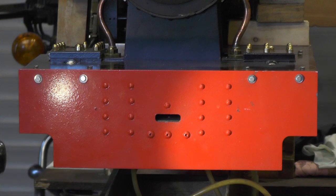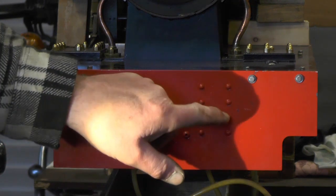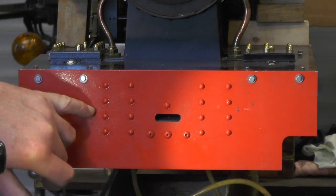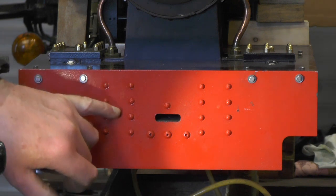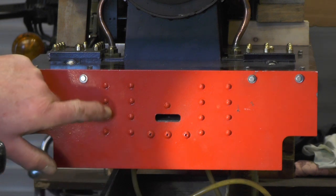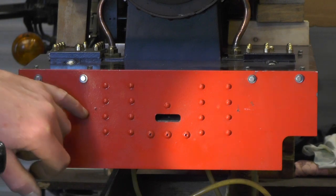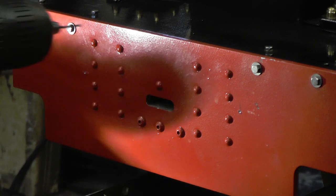There's just one thing I'm going to point out here — where the buffers are going to fit, two of my rivets are in the way. What I'm going to do — I know I've painted them now — but I've had a look and I can grip them with a centering on the bore, and I'm going to dish them out so that the rivets fall inside the back of the buffer. It'll just work out so those two will be in the recess of the buffer. I'm just going to spot it with a 16th drill first — it's just like putting a bigger centre punch in it.